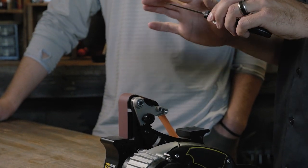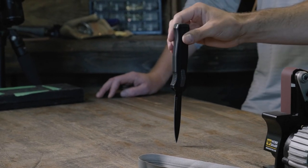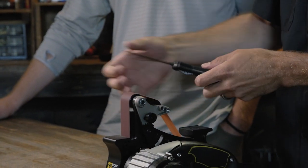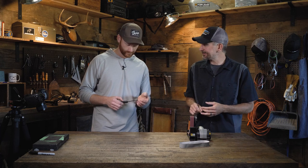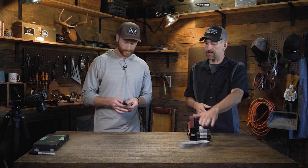I'm stopping on the middle of the belt — that's really key. The way I tip test is I'll come in here: when the tip is gone the knife will just kick out and slide. I tend to use my workbench, and it's really light pressure. The tip is sticking in every direction. I've got my burr all the way down the cutting edge. Before I go to the honing step and get that burr off, I just want to check my work: did I get the burr all the way down the length of the edge? Did I get the tip back? Did I get the nicks and chips out? Does the height of the bevel or the reveal match the factory grind? That's how I know when it's time to move away from sharpening and get into the honing.